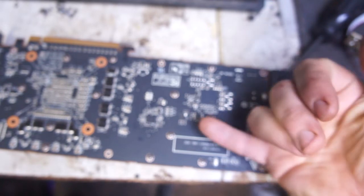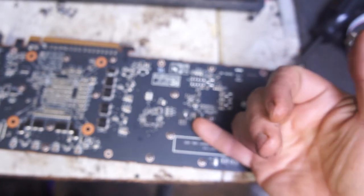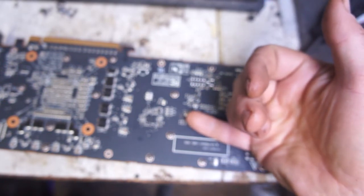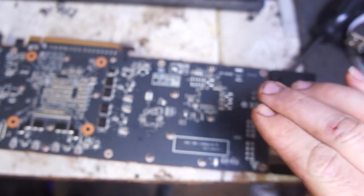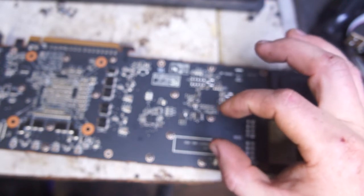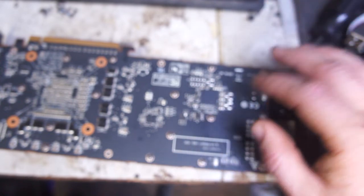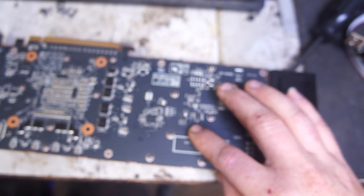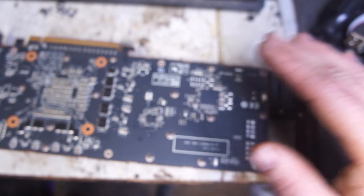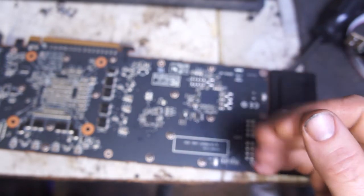One thing I forgot: after you connect this, at least in the software I use, there's a 'detect IC' option — because you need to tell it exactly what you're programming for it to do it right. The model number on this — well, it doesn't matter, the software didn't pick the exact same model number but it worked. The first six digits were right and the last couple are just variations — if you're not familiar with ICs, the last few digits often just denote variations in rated temperature range and things like that.